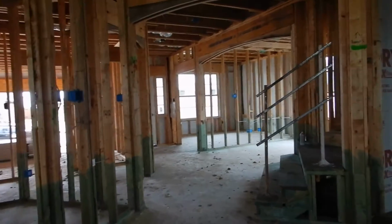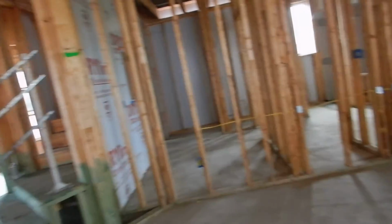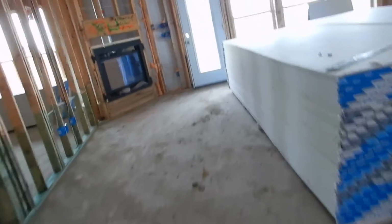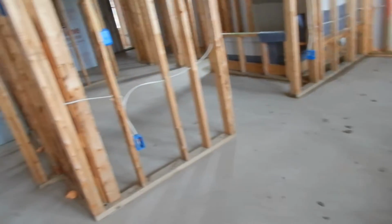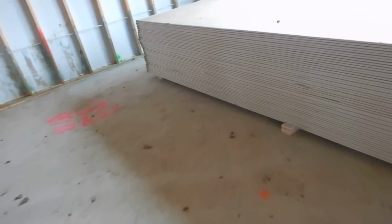But anyway, I'm not an engineer, but I do use engineering equipment. I use guidelines. I don't calculate slope. I don't have tolerances. Is this tolerance? I hear that a lot. Is it spec? No. I've got guidelines to help me render an opinion about how the foundation is performing. Obviously, this is a new foundation. But if you get an engineer in later, one of the things they say is we do not know how it was built, as built. So they are forced at that point to render an opinion based on limited information about how the house was built and how it measured at the time.